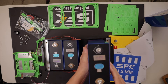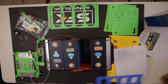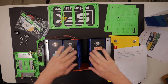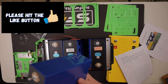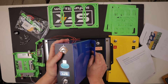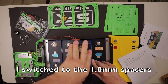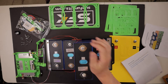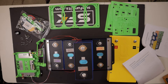Let's put the last cell in. It'll be oriented with negative, negative, and then a positive going right in between. Smooth side toward the inside where this last cell is going to fit, because these are going to compress a little bit — compress that foam and be under some pressure as you fit that last cell in. Make sure you get it in the proper polarity orientation. I'm using the 1.5 millimeter shims. You can mix and match the shims too — if you wanted to put a 1 millimeter shim in there, you could do that as well.